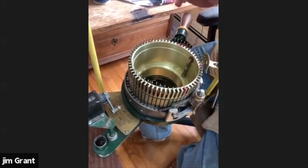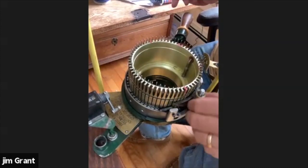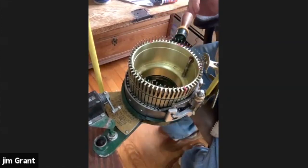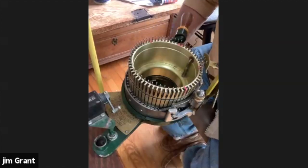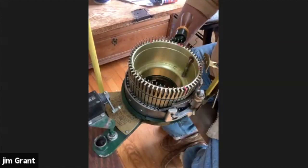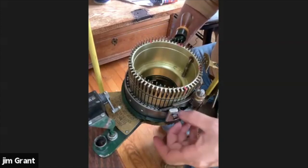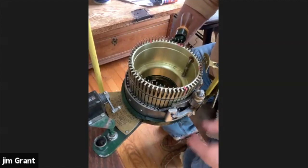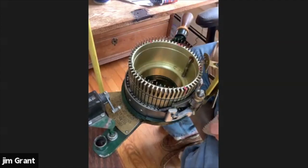Yep. All right. So they're a complicated, simple machine. Two screws and a nut hold the whole thing together. The two screws underneath are how you can change out your cylinders. This nut controls your V-cam, and your V-cam controls the size of your stitch. It's called a tension, but it isn't. It's how big your stitch is, how small your stitch is. The more you crank down, the bigger the stitch is, the looser the tension.